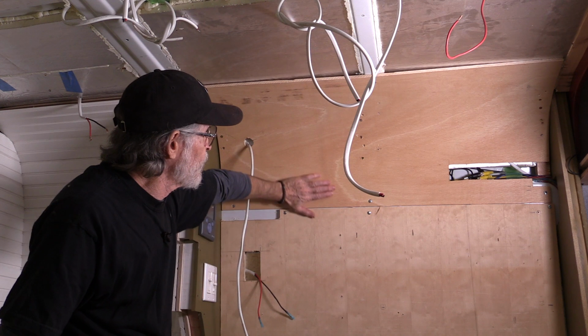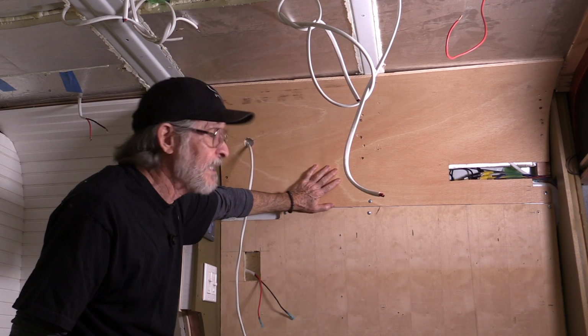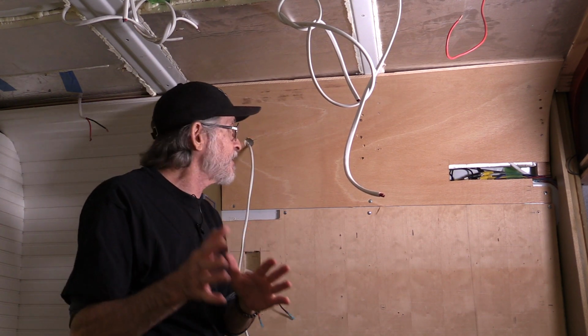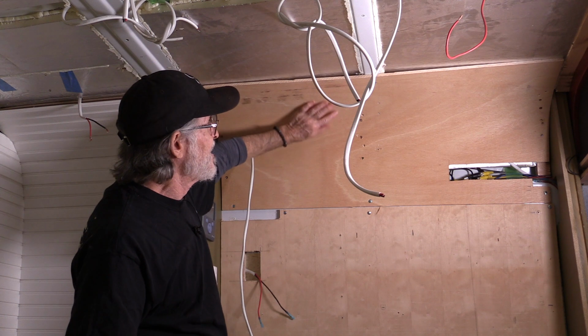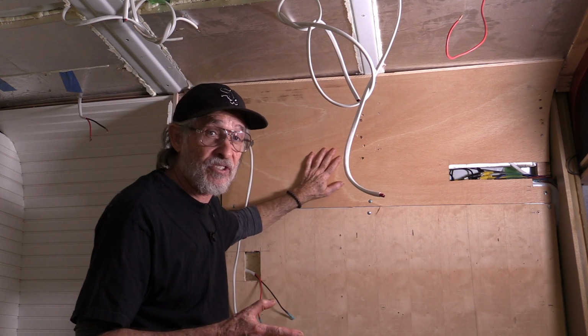And the beadboard's going to wrap right around this cove. This is the first cove we've installed. This piece of plywood is called bending board or wally board or wiggly board, whatever you want to call it. It's 3/8, so it almost flushes out perfectly with the 1/2-inch plywood. And it can bend around almost any radius, not much tighter than this though.